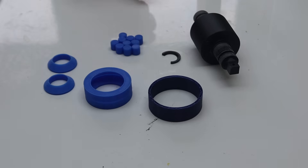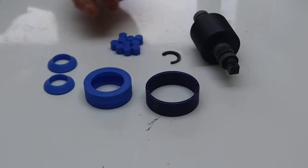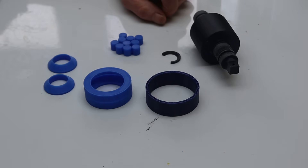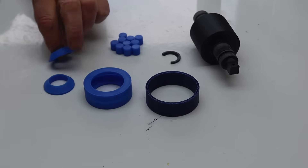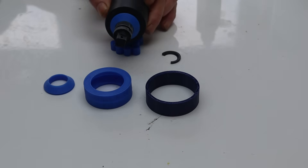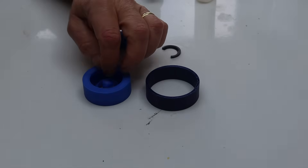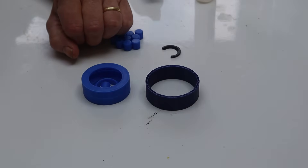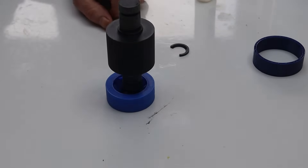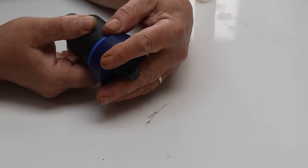To create our bearing we've got these parts: the outer sleeve, two cones, ten rollers, a sleeve of TPU to fill the space between the rollers, and a clip to hold the whole thing on. To put this together, we take one of the cones, slide it onto the center rotor and glue it in place. Then we take the other cone, drop it into the center of the sleeve, and with our ten rollers we put them in place in a cross bearing configuration. Then we take the center rotor and feed it through the center, lift the bearing up and put the clip in place.